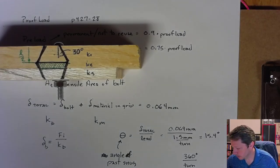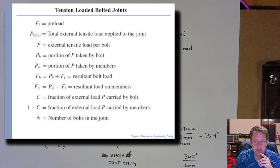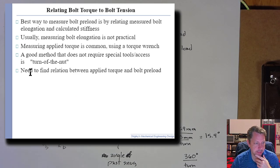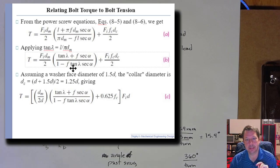There are also three factors of safety to consider for bolted fasteners. The first is NP — factor of safety against the proof strength of the bolt. Remember, we're setting preload at 75% or 90% of proof load, so you can expect NP to be a pretty low number, though it still needs to be greater than one.